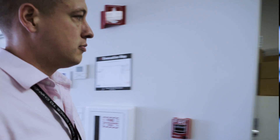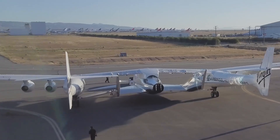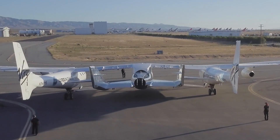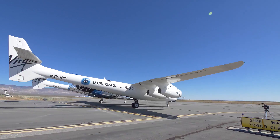I'm about to go up to mission control. I'm specifically responsible for the load and the structure, so I'm watching all the strain gauges on the ship and the load cells and making sure those are behaving normally as they move the flight controls, pressurize bottles, and actuate the feather locks before we go fly.